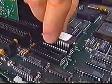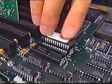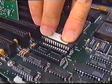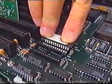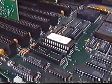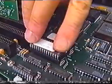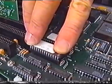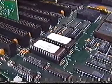Insert the first new ROM in the socket. The documentation that came with the chips and their labeling will help you decide which ROM should go in first. Align the pins correctly over each socket hole and press the ROM into place. You may find it necessary to rock the ROM back and forth as you're pressing it in. Repeat the process for the remaining ROMs.